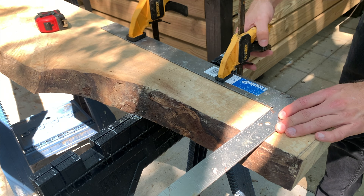I was really happy with how this Monocoat looked on the table — spoiler alert, I like this one better than the clear table I made before. After applying the Monocoat to the top surface and sides, I used a polishing pad to really push it into the surface and fill all those voids, which was especially helpful on the sides. I recommend using both the spreader tool and a polishing pad. After giving it another 10-15 minutes, use rags to remove all of the excess product — you really want to remove as much as you can.